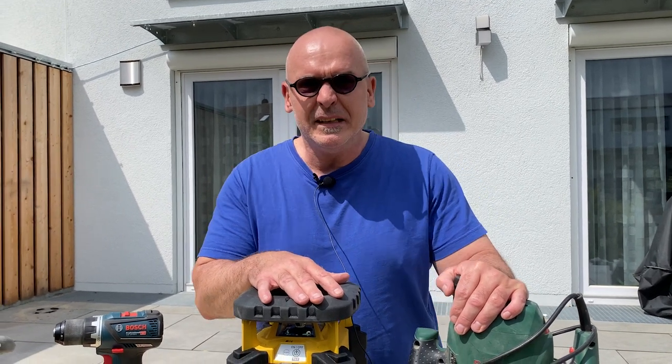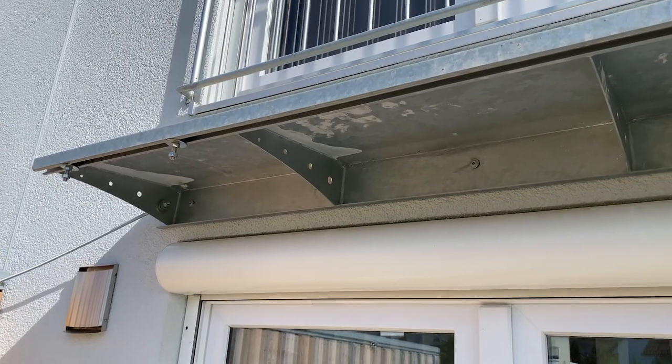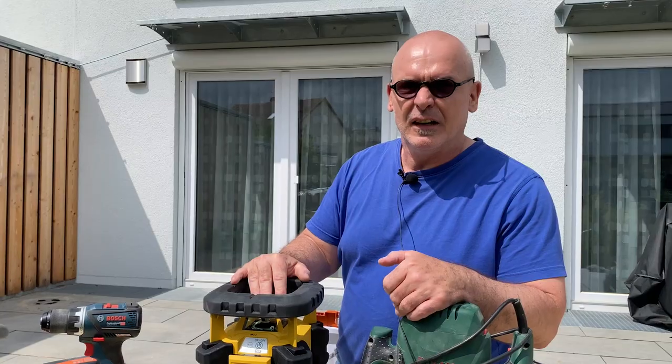I also want to point out - you can see up there there's still a small existing roof cover. That's easy to solve since only partial-thread flat-head screws are holding it. We'll remove that first. Then I start with the Rähm. For the Stegdoppelplatten, they must be installed with a minimum slope of 5 degrees. Before you pull out your sine-cosine-tangent knowledge: 5 degrees corresponds to a height difference of 8.5 cm per meter of length. So multiply your roof depth by 8.5 cm and you get the height difference between eave and ridge. I'll stick to the 5 degrees. With round numbers it's easy to set - both on the circular saw and my Bosch cordless miter saw.